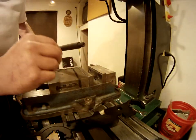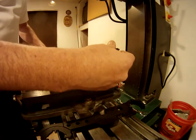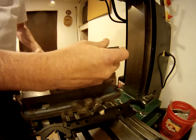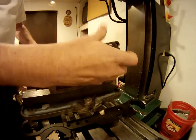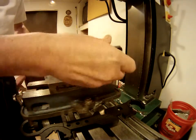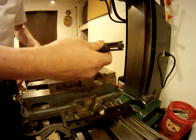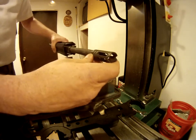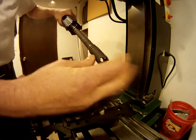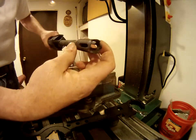And then after you're all done, what you want to do is look at your muzzle brake — this is a Yankee Hill muzzle brake I'm running on this particular one. After everything's tightened down the way you want it, you're going to lock it up in the vise again and get this tight. On this particular one, you want these slots to run about 90 degrees up and down. You can see it's uneven around, but it's got a wider gap here, so I run it, tighten it down, so these are 90 degrees. That's pretty much it.